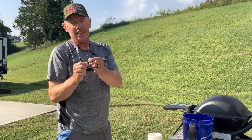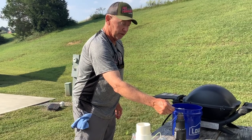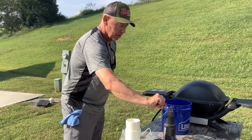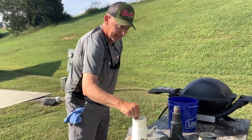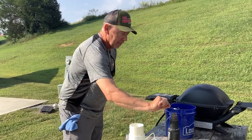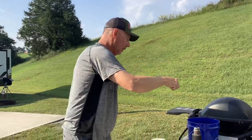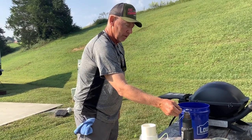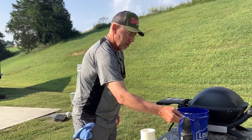You don't want to heat the lead too long — you can overheat these things to where the paint will bubble up and not make a good coating. I'm heating the lead, rotating it — one side then the other — to get a balanced heat all the way around. Then I'm sticking it into the powder paint, reheating it just a little bit to smooth it out, and there you go — a good smooth powder painted spinnerbait. I hang it up on the bucket. I've already pre-bent all these spinnerbaits, so do that before you start painting to save time.